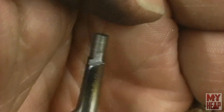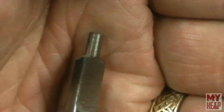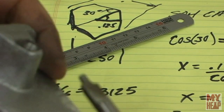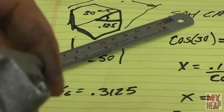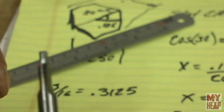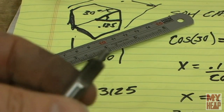I have the pen drill in the vice. I've started filing the back edge — remember this is spinning this way as I'm viewing it from the working end. I want to file this back to an angle of about five to seven degrees until I get very close to the edge, then I'll turn it around and do the other side. You can see I've filed it back on that side and filed it back on that side. These will create my cutting edges so that when this goes in like this, it will cut. Before we can use this to cut anything, we'll have to harden and temper it.